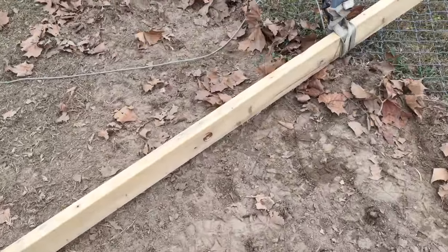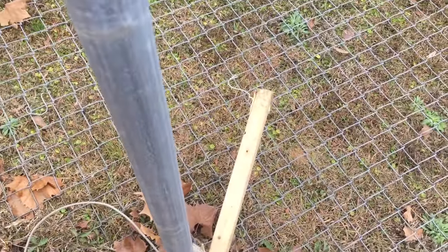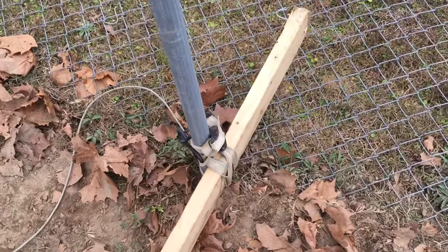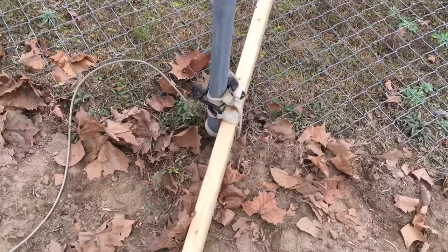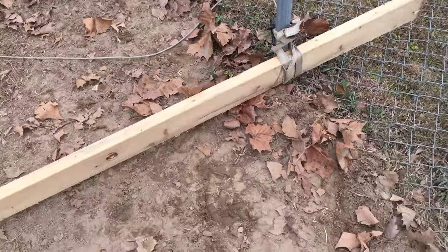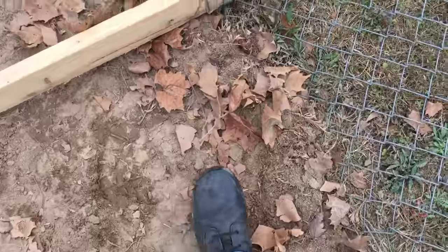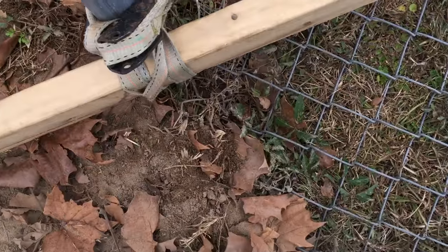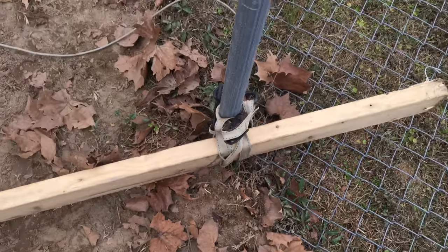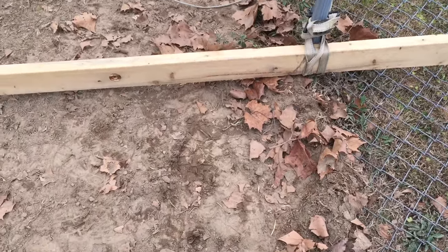What's up everybody, I want to give you all a quick video on how to pull a chain link fence post out of the ground. This works about 90% of the time, even if you've got the fence post concreted down into the ground. Basically, you're gonna tie the piece of lumber to the post that you want to extract — excuse my dog over there — and use this 2x4 as a lever.